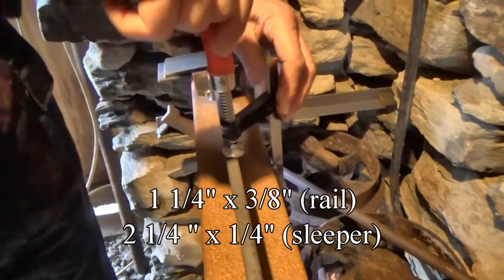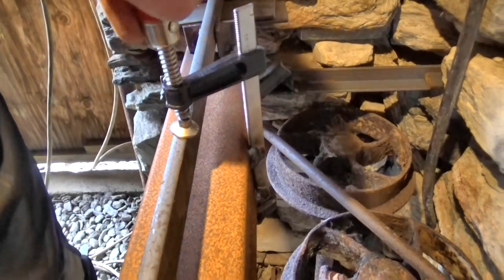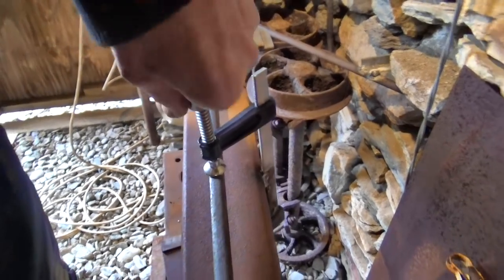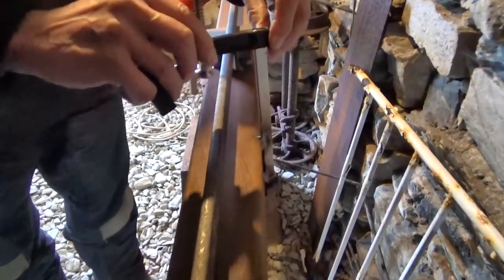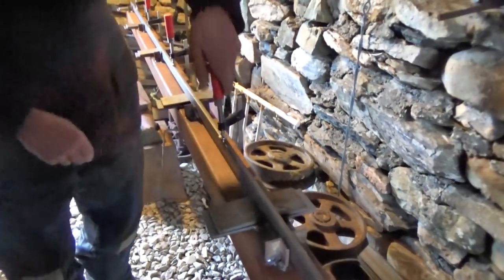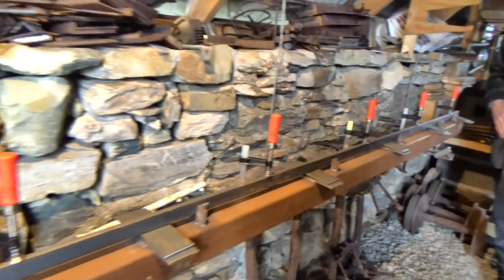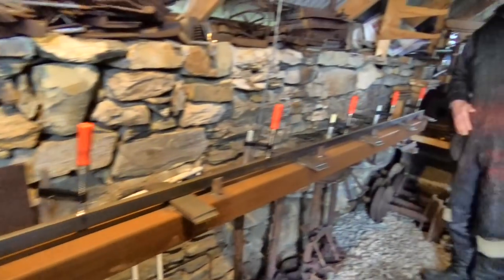Now you do the cramps up until the rail's pressing on the sleepers. He's welded on lots of little cramps — he's a smart lad is Chris. Done this before. The rails are flat bar on its edge welded onto flat plates, which are sleepers in this part of the world and ties in the US I think. Chris's jig makes the setup quicker and more accurate, and it makes the welding really simple.